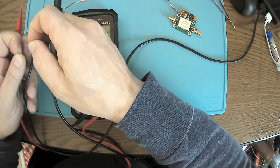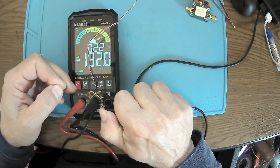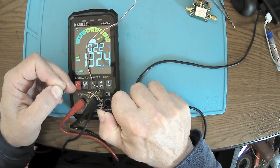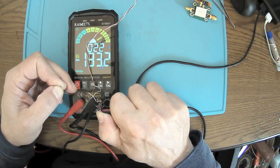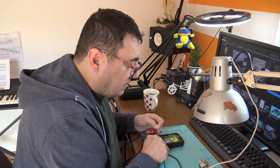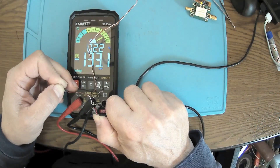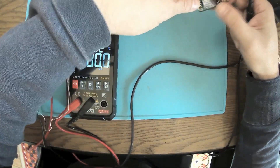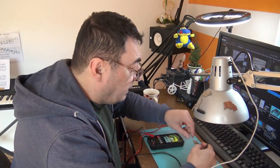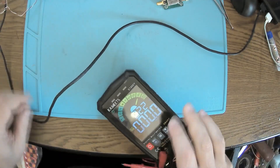Now let's measure the current. So we have 132 milliamps. It's growing a little bit because it's getting hot, but it's stabilized around 133 — so this is a very secure and long-term power supply. The amplifier is getting a little hot, but that's the way it has to be. Like I said before, this is a fake — I don't know — but it's a working fake.